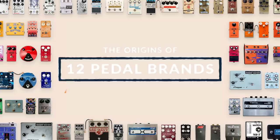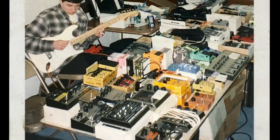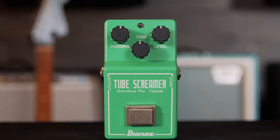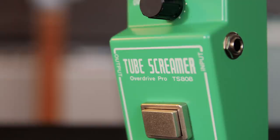Analog Man was a vintage guitar dealer and I've always liked pedals. I started getting into pedals and then it started getting harder to find the vintage pedals and I had been fixing them. So I decided I could build the same thing. I started building copies of some vintage pedals, and I started off modifying the Tube Screamers because I traveled to Japan and was able to find the chips that were in the TS-808s. This was even before the TS-9 was reissued - the TS-9 originals often had a different chip, so I would put the old 808 chip in them.